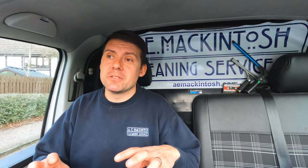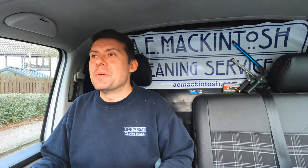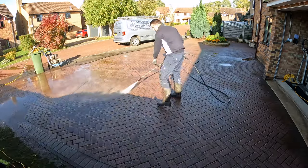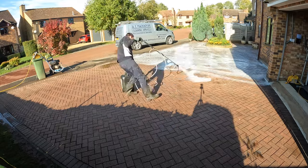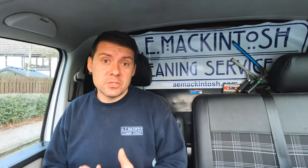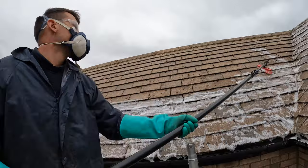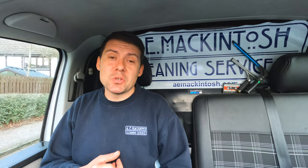If it's something you're looking to get into, it's really worth building up experience pressure washing on the ground first. Start off on the ground, build up experience, and get a feel for what you can achieve with a pressure washer. Most of the time the best results come from a combination of using a chemical along with the pressure washing approach. I find the same on the roof - I always do the biocide treatment along with the roof cleaning process as part of the job, always include it in the price. That's my added value - doing the best possible job and helping maintain the roof going forward.